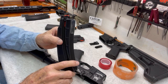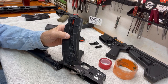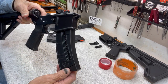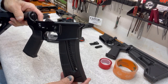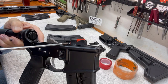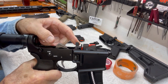The shim itself, when it's all together, is 2.76 millimeters. And now, when you put it in, it fits in there nice and tight. There's hardly any movement side to side. And what's important is this tab right there that pushes up on that bolt catch — you can see it working right there.